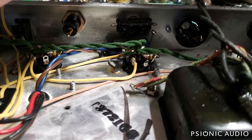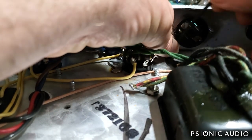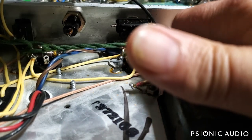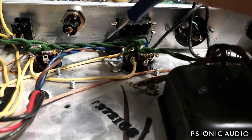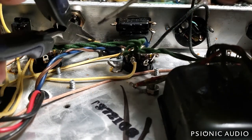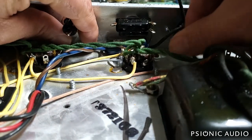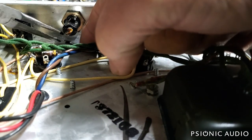I'm going to unwind this wire and make sure I have the right amount of slack. As far as the power transformer primary connections go, there is no hot and neutral — AC has no polarity, so it's not critical where things go. There's an old snippet of wire here that's been tucked in since 1968 — you always find something. That wire has just been in that bundle forever and probably never would have moved until now.